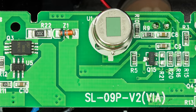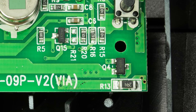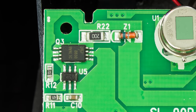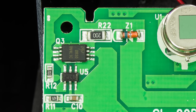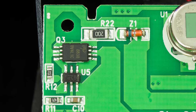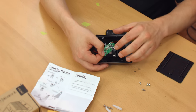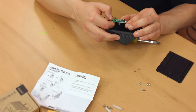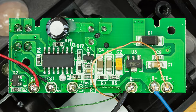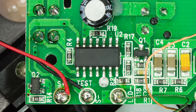There are the usual sorts of support components — resistors, capacitors, and even a zener diode, and what may be a voltage regulator or transistor labeled X03V15. An internet search didn't turn up anything on it. For your reference, the 8-pin chip is labeled 8830BV4L1C, but again that didn't turn up any info on Google. Just based on how it's wired, I'm going to take a guess that it governs the charging of the lithium cell — setting charge current and voltage and providing overcharge and over-discharge protection. The 6-pin chip may be a voltage regulator involved in the charging. I'll leave the really detailed circuit analysis of LED fixtures to Big Clive, who actually knows what he's doing. You can check out the larger images of the circuit board on my site, s.co.tt. Around the back of the board is some more support componentry, and what is probably the mastermind of the whole operation — an unlabeled 14-pin chip. I'm guessing it's some kind of microcontroller, but beyond that it'll remain a mystery for now.